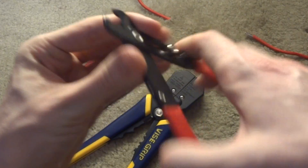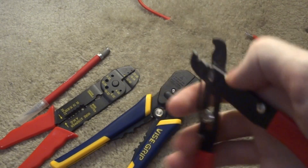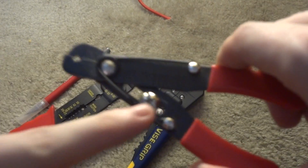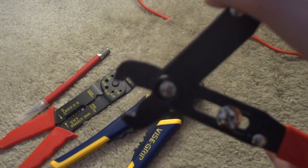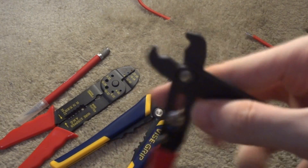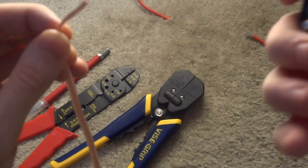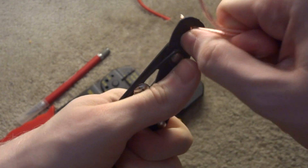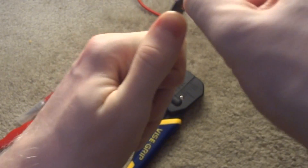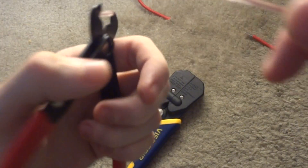This is your very basic style wire stripper, found in most inexpensive hardware sets — it's also the cheapest tool you can find. Essentially, you loosen this screw and move it up and down to adjust the spring, setting it for the kind of wire you're going to strip. I'm not sure if this one is set correctly for this 18 gauge wire, but we'll see. You put the tool over the wire, hold it, pull on the other end, and turn it to get it to break the insulation. Sometimes it'll come right off — though I don't think this is going to strip this one cleanly.